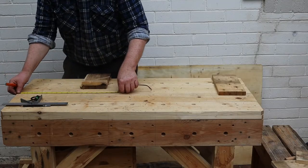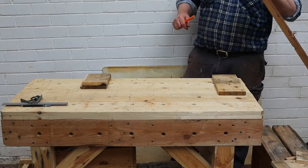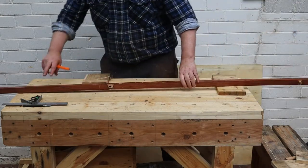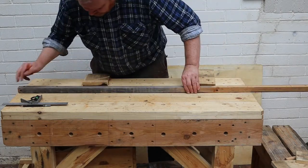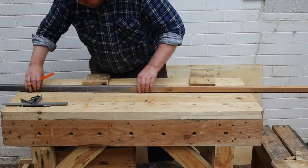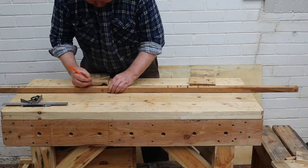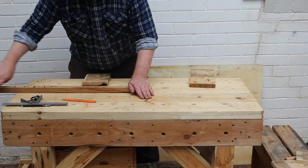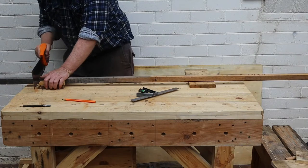Once I had the pieces cut out for the sides I marked my workbench with the length needed for the corner blocks. This made the process of marking and cutting the 24 corner blocks much faster. I didn't cut these on the table saw because the long stick would have made the job awkward. These pieces also don't need to be cut to a super accurate length — within two to three millimetres, about one eighth inch, is plenty good enough. Now let's cut off those pieces with the tenon saw.